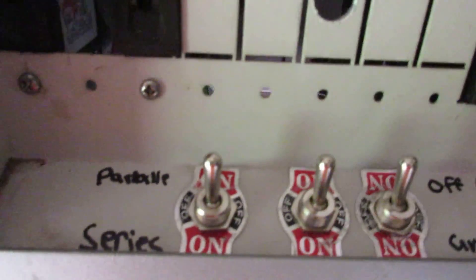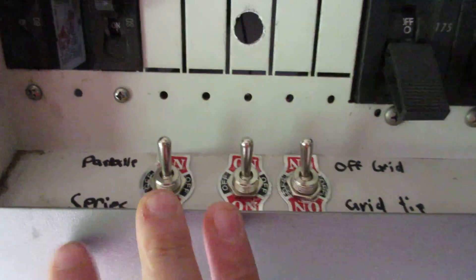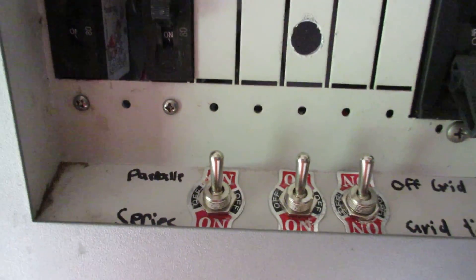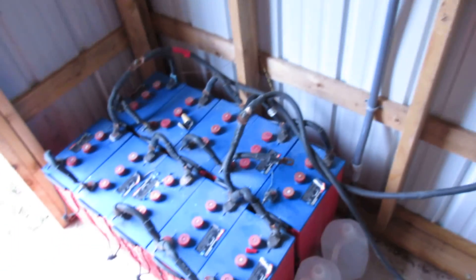It's coming in at 70 volts because I switched from series to parallel — the four panels, four panels, and three panels wired in parallel with each other. I'm getting 24.6 volts, 11 amps. Of course it's getting dark out so that's all it will produce. It'll produce 60 to 80 amps at 24 volts when the sun's out, which is enough to charge the batteries.